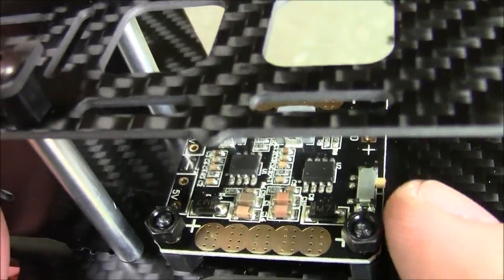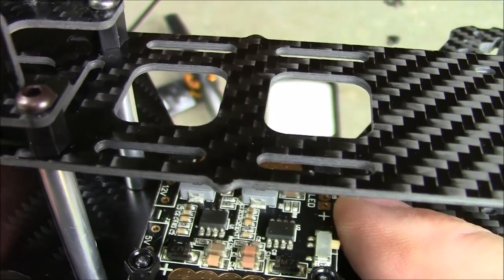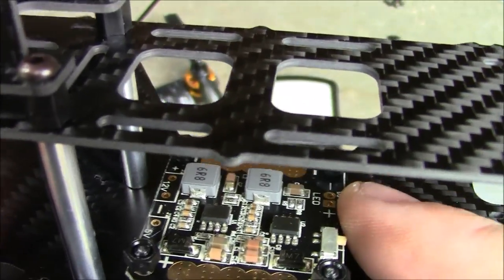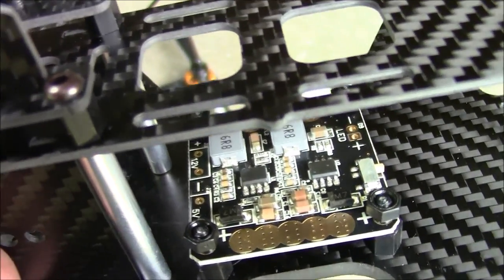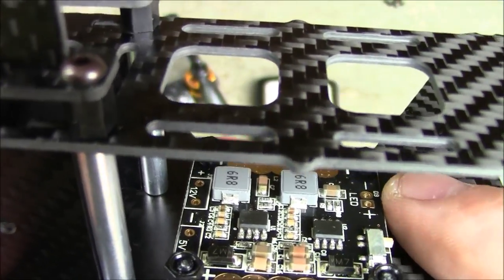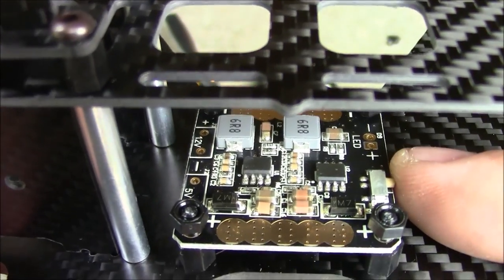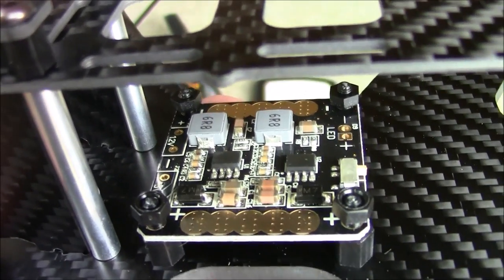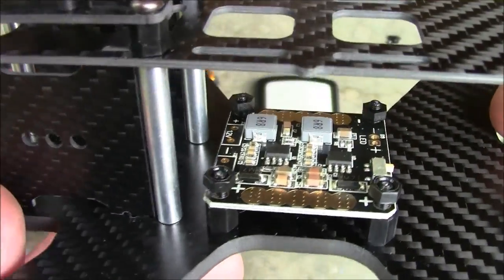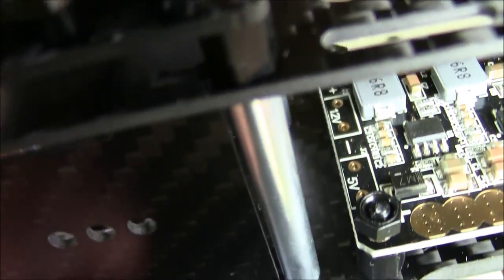This does come with a power distribution board and has a little switch on the back. The switch controls these LED outputs back here, and those LED outputs are going to output whatever voltage is coming in. So you want to make sure if you're running a 4-cell battery that your LEDs are rated for up to 16.8 volts, but you can also flip it off. You can also run your video transmitter off of this as long as it can handle the incoming voltage, and you can put it on a switch so you can flip the switch off and your video transmitter will be turned off. This allows you to do some more testing on your quadcopter at races without interfering with anybody else's video transmission and causing them to crash.